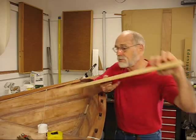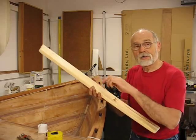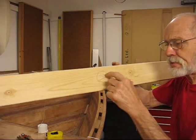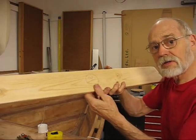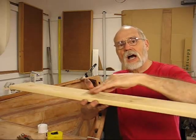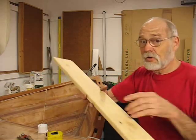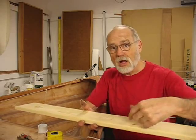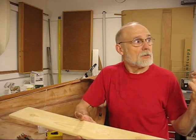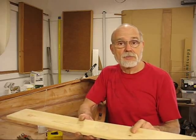I'm going to go ahead and start cutting out the hole. Just to give it a little bit of extra strength, I'm going to take some scrap plywood and laminate on the back to give the mast partner a little more strength, because I'm going to put a pretty good sized hole in it and I want a little more backing. When the mast is pushing against it, it's pushing against one of the sides — either pushing this way into the hole or the other way. There's not a whole lot of up and down force on it, though I do have a couple brackets for turning blocks that'll hold the top of the sail up on the yard arm, or if I'm doing the sprit sail the sprit pole gets held up on one side and the top of the main gets held on the other.